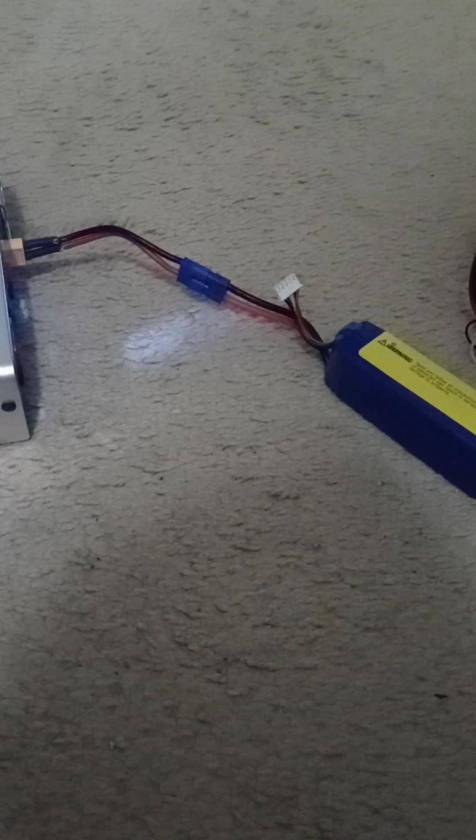I'm sorry about my mumbling on stuff. So I would say that the only time I would use a 4S battery to power this charger is that I would only use up to 2 separate channels, having an actual rechargeable battery plugged into each of the channels, with each rechargeable battery having a nominal voltage of no more than, I would say, 6 volts or so per individual rechargeable battery plugged into a channel.